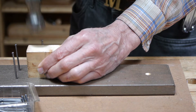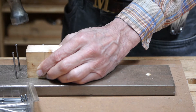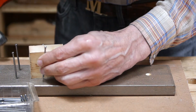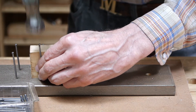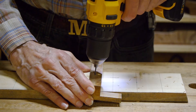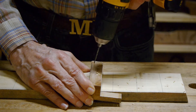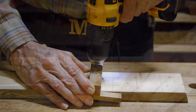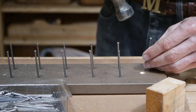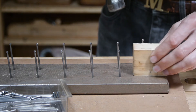The slight angle and the small heads on the nails served to keep the holder from accidentally sliding off. Since I was fabricating three of these racks, I thought it a good investment of 10 or 15 minutes to make a simple jig for drilling pilot holes at the correct angle and spacing for the nails. A small block of wood of the appropriate thickness made a handy gauge for driving the nails to the proper height. You'll notice I painted my racks, but of course that's not necessary. Two screws hold each rack to the board behind my lathe.